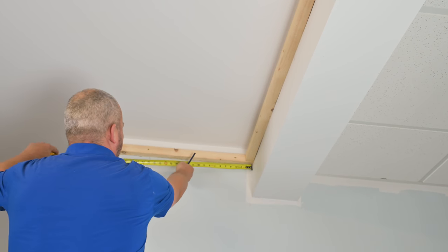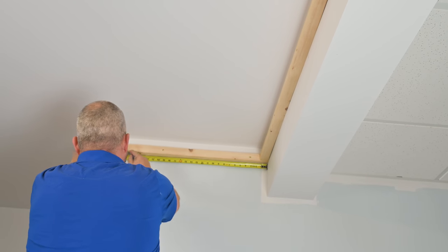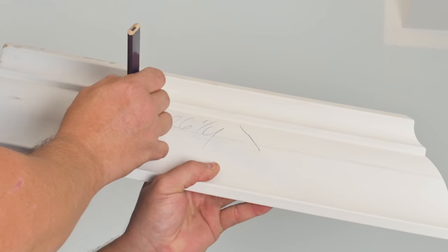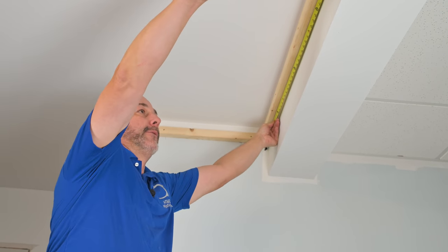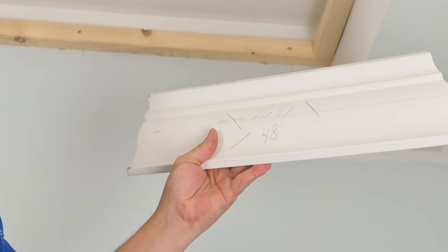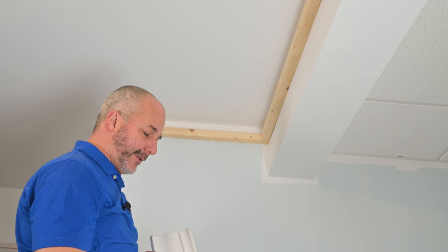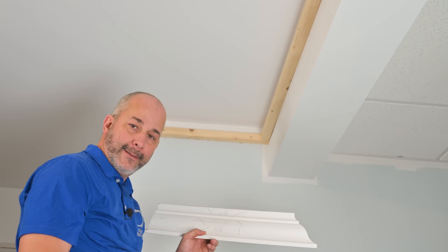Let's take some measurements. Because we're cutting upside down, we have the advantage — we need one measurement, from here to the outside corner of the wall, which is 26 and a quarter. What I do is write the measurement and mark the angle of each cut on either side — that's how I do my templating. For instance, the next one we'll go 48 inches, and that one is going to be an inside corner going straight. And over here it is exactly four and seven eighths — this is an outside corner and an outside corner. This is my template system: you put your number and write the angle of the cut, and then just go cut that on the saw. Piece of cake.